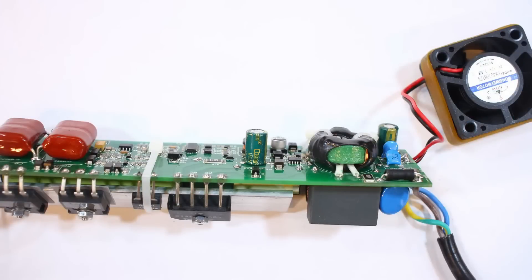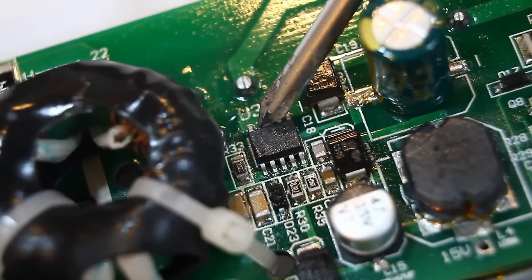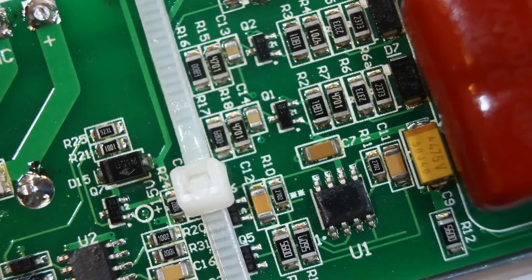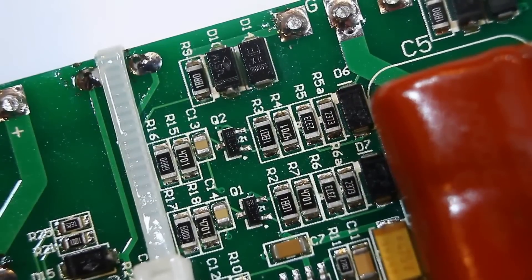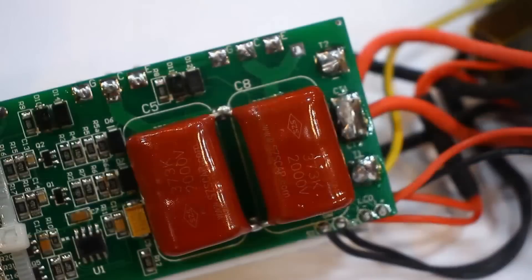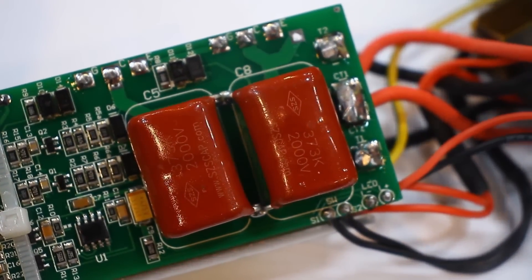Given what's been said, you can only guess which chip is responsible for what. On one chip, a power supply is likely assembled to power the control system. Next, there should ideally be a PWM controller. There is probably a frequency auto-tuning system, and another chip is involved in that unit. Next comes the driver for controlling the IGBT switches. On the same board, we see a couple of capacitors used in the oscillating circuit — not the best capacitors for this part, but not the worst either.